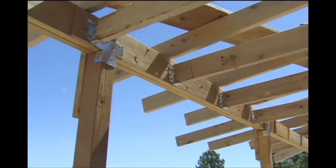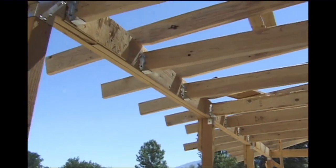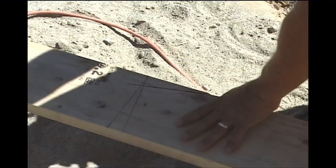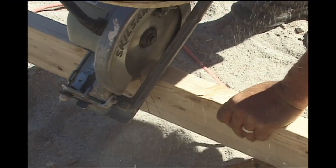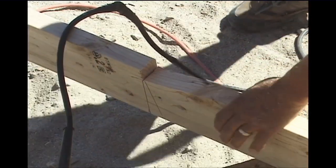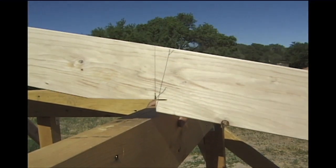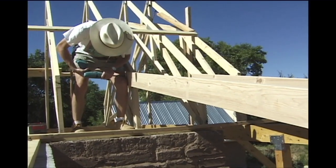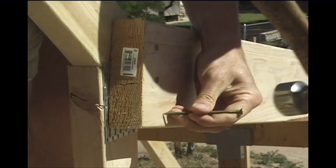The roof over the north rooms of the house will be built by us instead of using a pre-built truss. Tom has cut each upper 2x6 to the proper length and is now notching it so that it comes in direct contact with the 4x8 inch perimeter beam. Mark then screws and nails the other end to the pre-manufactured trusses, forming the lower pitched roof on the north side of the house.